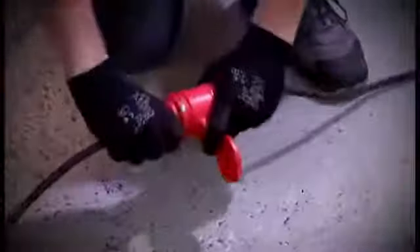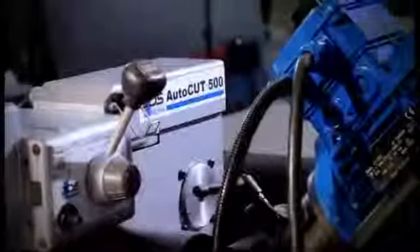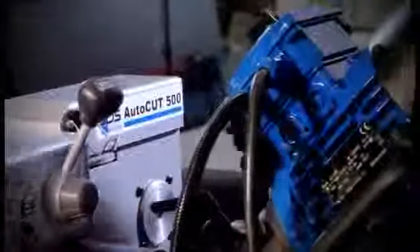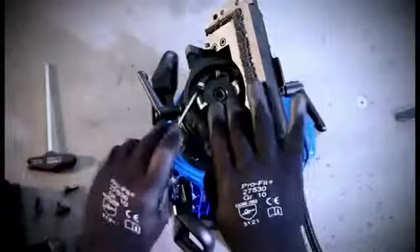In the following section you will see how to change the tool. First, disconnect the machine from the main supply and pull the connection plug between the milling motor and the basic unit. Loosen the four connection bolts and place the milling motor upright onto the protective ring. Each reversible disc can be repositioned up to eight times before it must be replaced. The correct position in the milling cutter is secured by means of the lateral flat side.